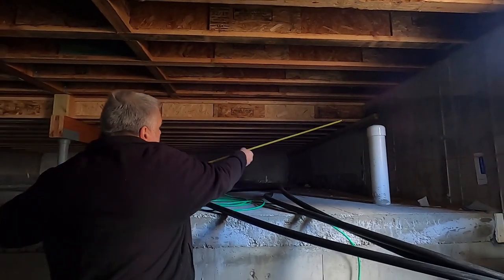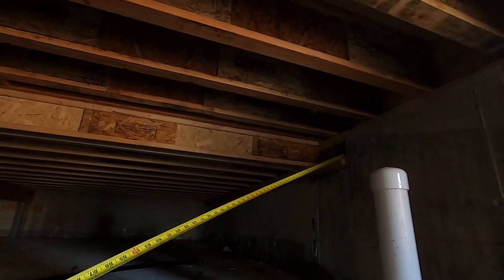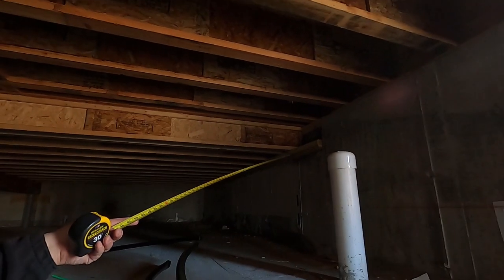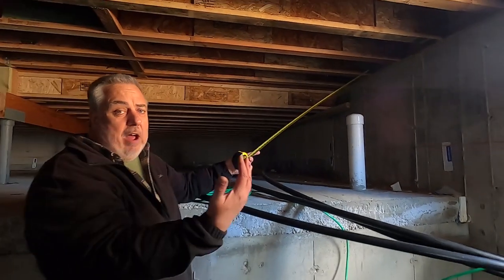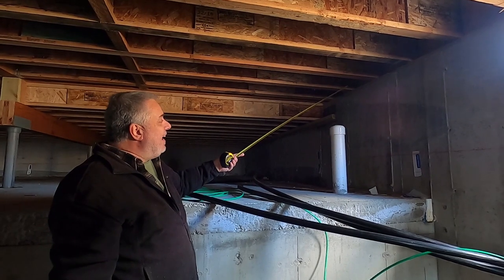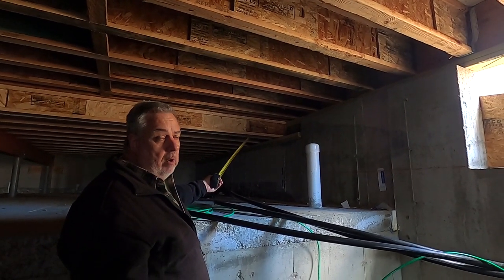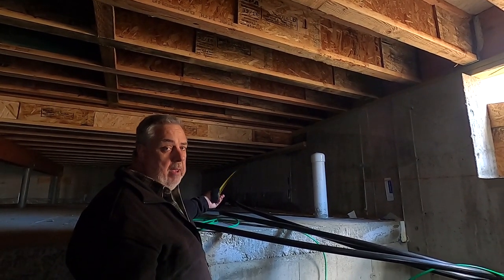As the I-joist goes in, I actually have a drop in the concrete footing — it drops down onto a little shelf that allows the load from these floor joists to be picked up and transferred down into the foundation wall without changing the height of the foundation wall. So on the outside the foundation wall looks normal — a nice straight line — but inside I'm able to provide that shelf and achieve that 14-inch drop in the floor assembly.